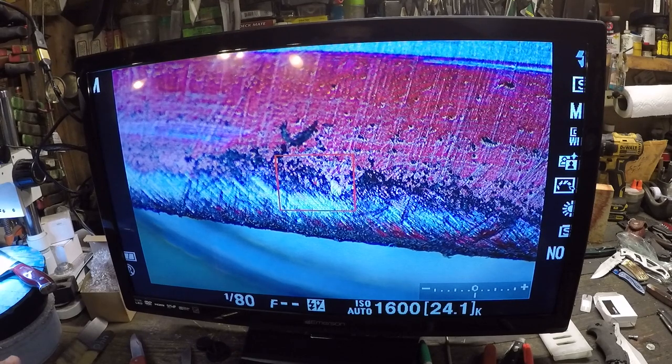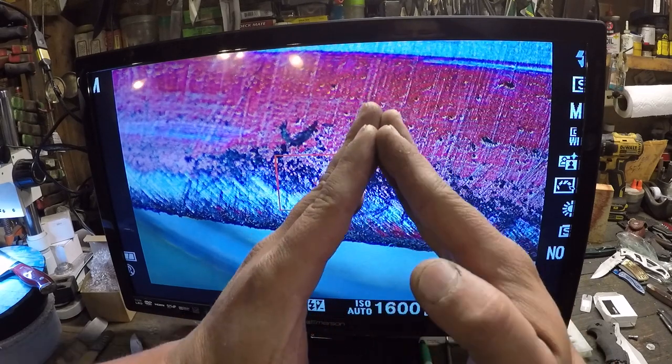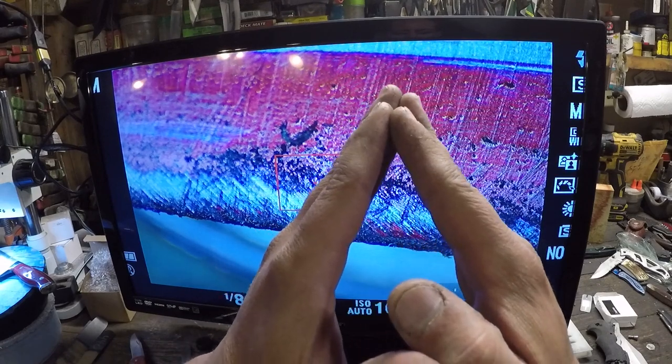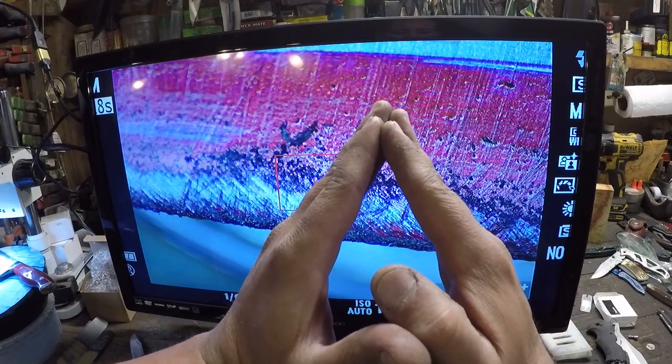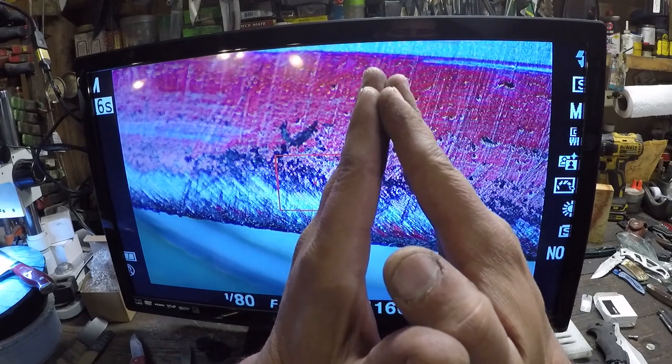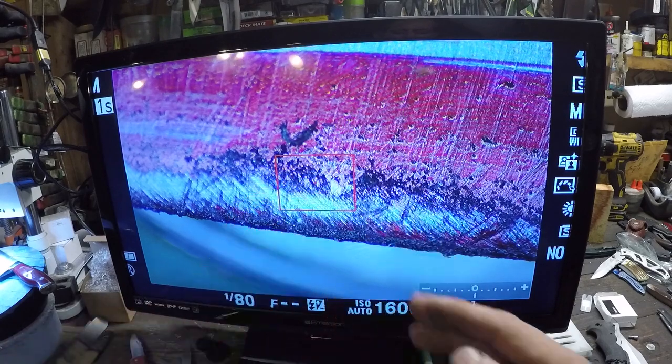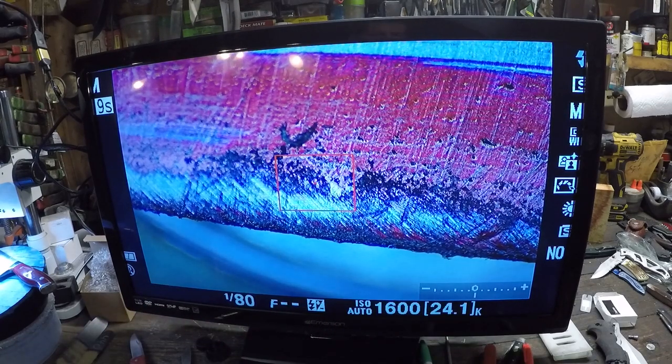Yeah, this knife's going to be quite a bit of work. So, with an edge this dull, it'd be best to have your edge kind of centered, okay? So that you had an edge that looked like this, fairly even on this side and on this side, okay? Which would be a little bit more desirable than having an edge that looked like this, or having an edge that looked like this, okay? So, if you can, it's best to try to grind or sharpen evenly.